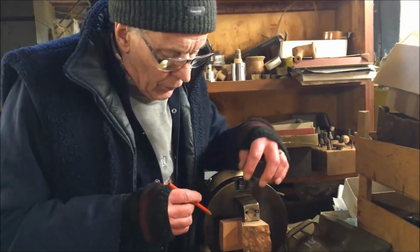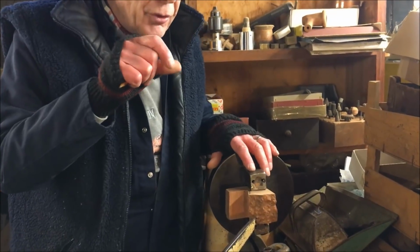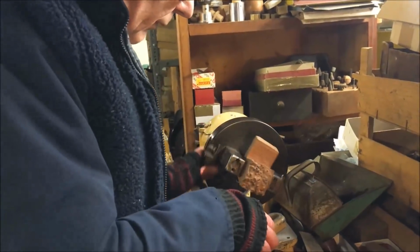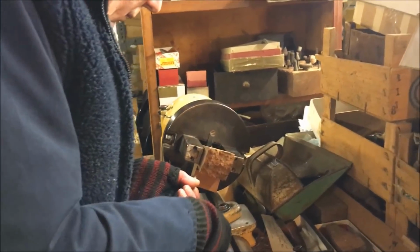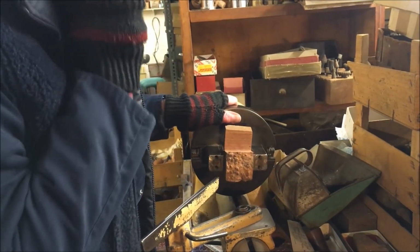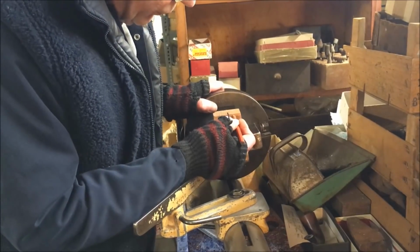But if the chamber stops way up here, you're never going to reach it with a drill. With a drill, yeah. If you go too low, you end up with a thin bottom and you might burn out or poke out or whatever. I suppose you could take these corners off with a bandsaw. I'd certainly trim this down with a bandsaw. Yeah. I'd normally do that after the initial turning in this way. You'd trim it off down there.